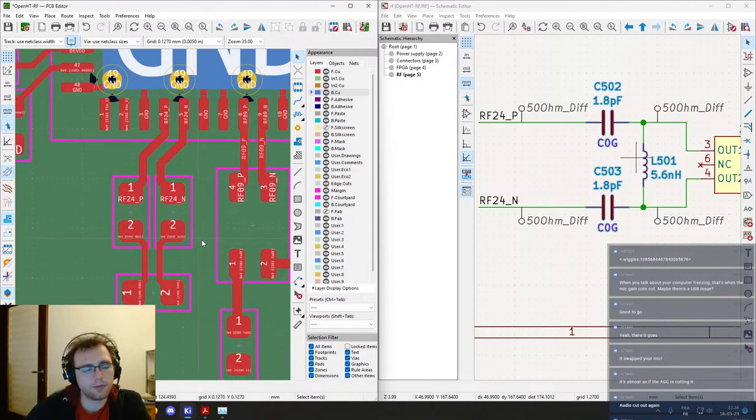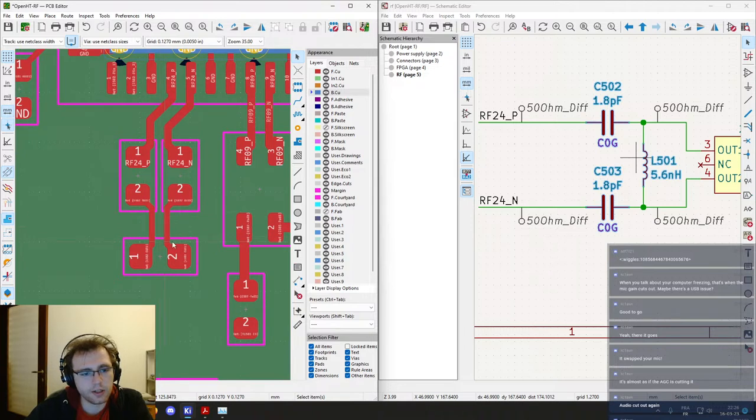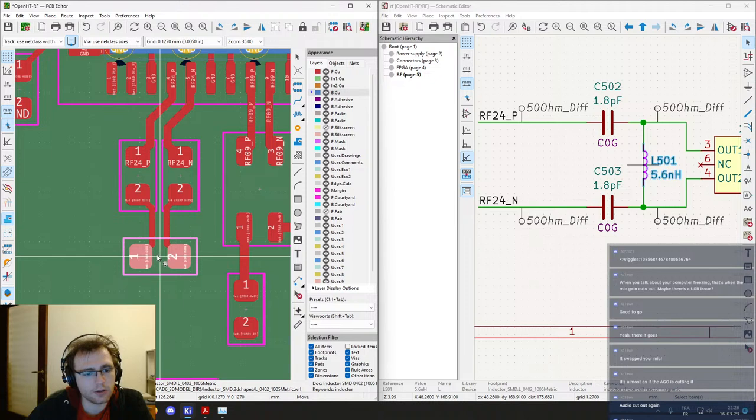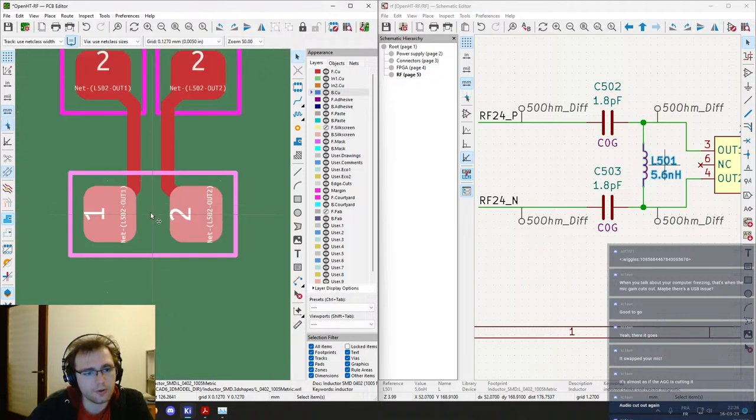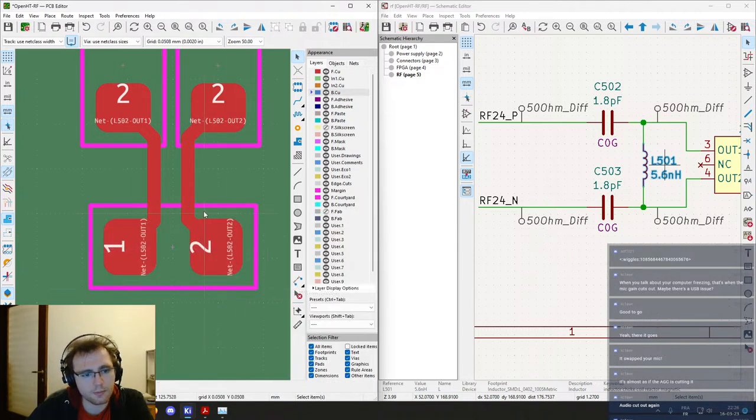So yeah, anyway, if it's not properly matched, it's no big deal. Same thing goes here. It's not very long, so it doesn't need to be matched very precisely. However, I'm gonna try to keep them as aligned as possible. So I'm gonna pick finer grid, remove the tracks quickly,